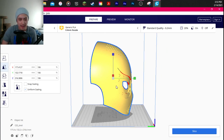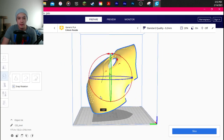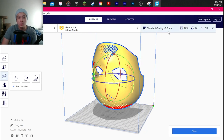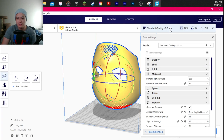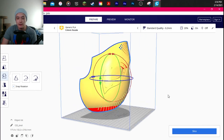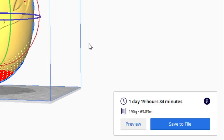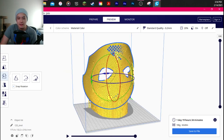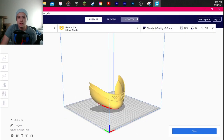The next thing I did was, because I didn't want too many supports, I turned the actual face shell itself 180 degrees and printed it out like that. Since I didn't want it to print for too long, I didn't print it at super quality — I printed it at standard quality. Like I mentioned, I tried printing at low quality but it ended up breaking on me. At standard quality, you click slice and it tells me it's going to take about a day and 20 hours — roughly two days to print the entire face shell. You can hit preview and it shows you what it'll look like when it's all printed out.